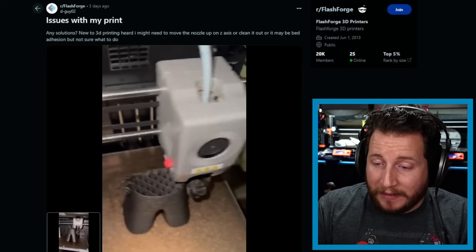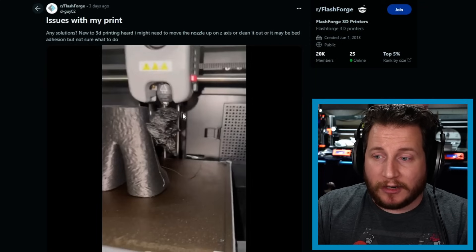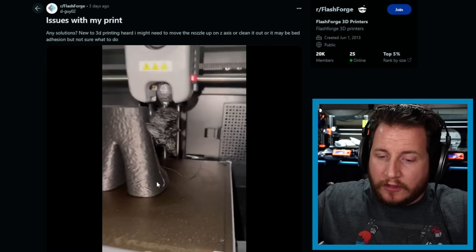The big thing with 3D printing: think of it like you're making something out of wet spaghetti. If you can't make that thing out of wet spaghetti in reality, you're not going to be able to 3D print it either. You need to support those areas that are overhanging. I'll give the machine fair credit — that is better than I would expect. Likely a string got caught at some point and it will eventually recover. The rest of the print looks just fine, but you will need to support those arms with support material going down to the bed.